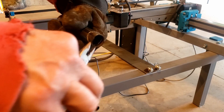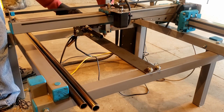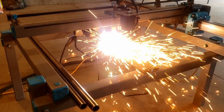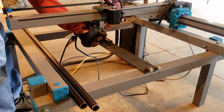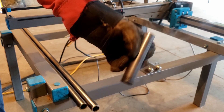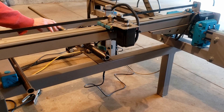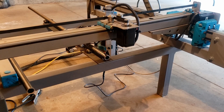Just a little bit of slag right there on the corners — they come apart real nice, just like that. One more of those to do. Nice cuts, just pop that apart — a little warm. This is a longer tube and we want it supported by all three bearings, so we flip the cutter around so we can get it supported on all three ends. We're ready to do this cut.